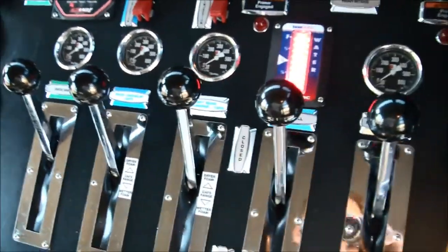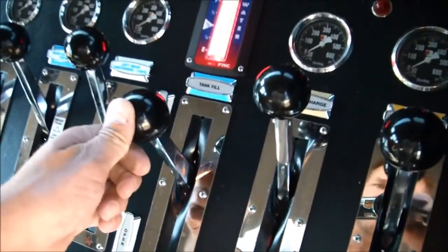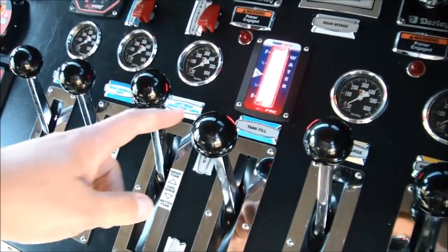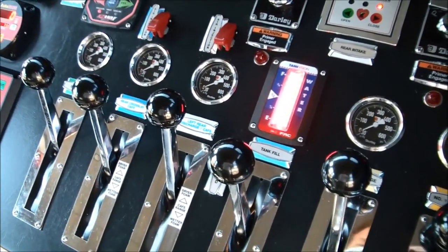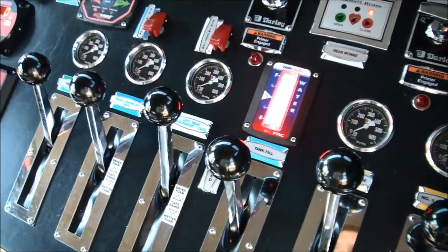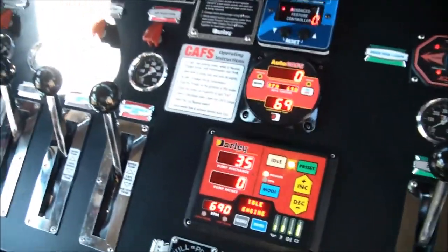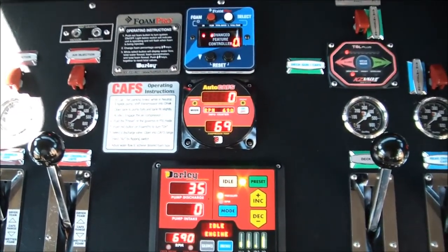I also recommend that you just crack your tank refill just slightly. That might even be a little too much. You just need to crack it slightly so that you provide a little bit of circulation from the tank back to the tank through this small, like a 2.5 or 2-inch refill valve. That keeps the water flowing so that there's no hot water being bottled up inside the pump if the pump were to sit here and not discharge any water for a great amount of time.